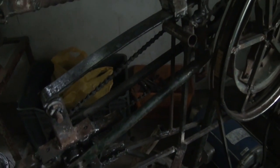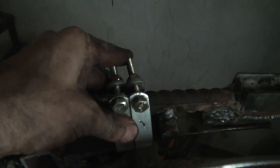So what else is there? Last component, the cam, I actually talked about in another video. Check out that video if you're interested in how I made that. What I did here is I've got a leaf spring from a small car, probably a rickshaw one. I bought that and I built this little box here, which I welded on. I had some bolts welded inside and going through, and then I have two holes, and it's a bit dark, but two holes that are holding the back of the leaf spring here. Then I clamped it down here as well.